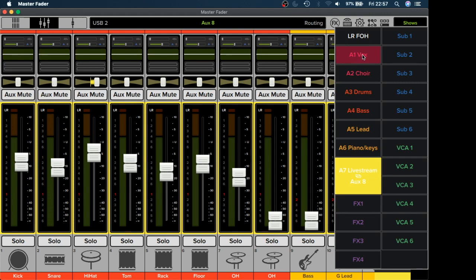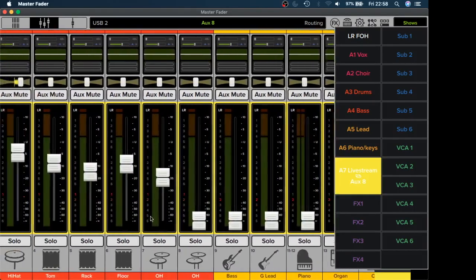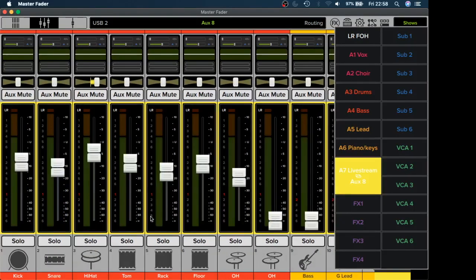You don't have to use AUX 7 and 8 — you can use a single AUX if you want mono, but I don't see any benefit to that because it won't pick up any of the panning. If you've got a big group, you definitely want stereo so it's cleaner and clearer. You can assign those to 1 and 2, 3 and 4. I've used 7 and 8 because 9 and 10 are my mains, so anything in stereo gets clumped at the back, leaving other channels free for monitor mixes.